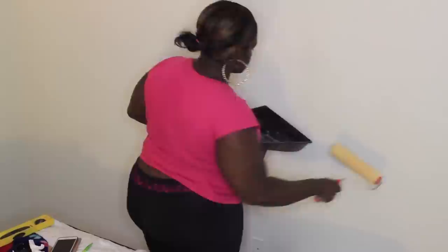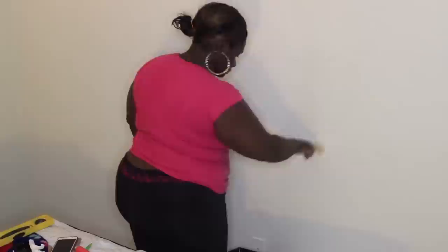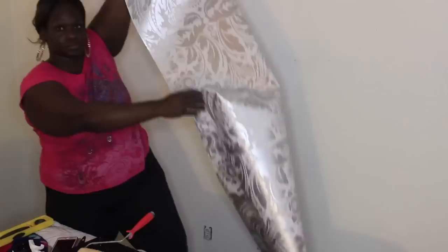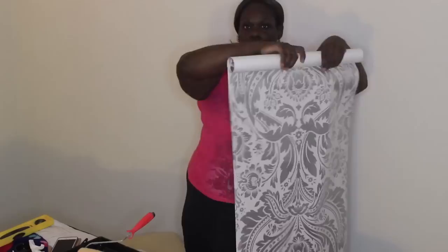You can see me using the roller and the brush because I wanted to make sure I got the paste evenly distributed with no patches missing, because I noticed if there's an area missing paste it will have bubbles later. After measuring the wall I pre-cut all the strips that I would need, and I rolled them from the outside in so when I started placing them on the wall it would be even and the process would go smoother.